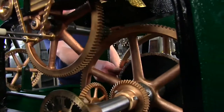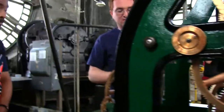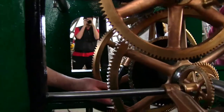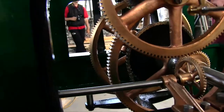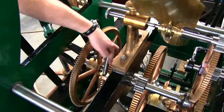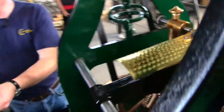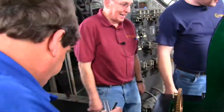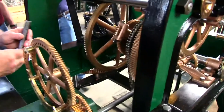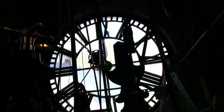With this little wrench, you can turn this a little bit one way or the other. If you look carefully outside, you might see the minute hand move. You can set the hand backwards or forwards — it also moves the clock here. Would you like to try it? Get to feel the torque. See how much you're moving it? You can see all these gears up here just a little bit — you're turning them all. You're turning everything. That's just so amazing that that little bit of turn can move so much. That's the whole hour. You're also using a worm, so you're geared way down.